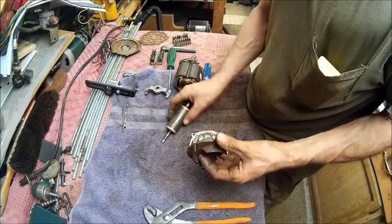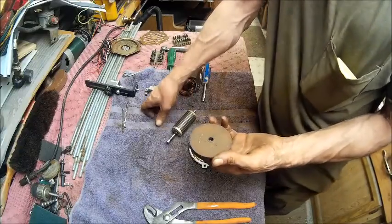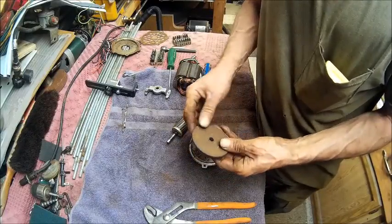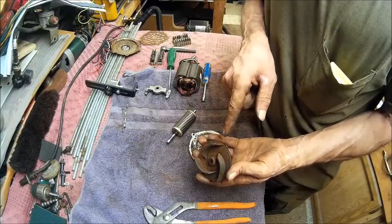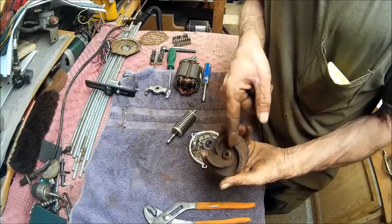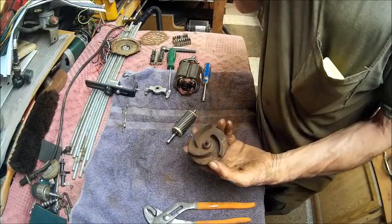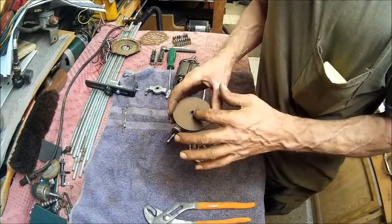And I think that would work, but to make sure that I have added strength for the turning process, I don't know how much torque this thing takes, but since I'm going to epoxy it, I'm going to take a little tiny drill bit and drill a little hole right here in between every one of these, right into that shaft. Just a small one. Basically, what that's going to do is fill this up.